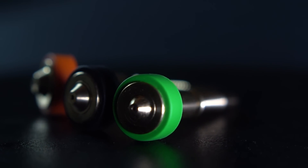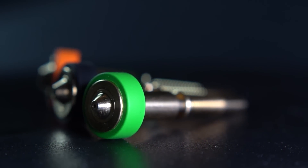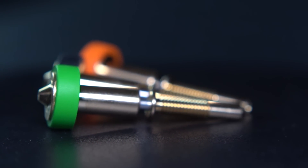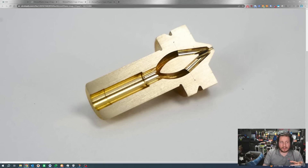With that being said, E3D has actually kept these nozzles relatively affordable given the technology and effort that went into making them. At about $40 a piece, while they're not cheap, these will enable you to run high flow materials. If you are looking to play on the fringe end and want to do it with E3D's Revo system, this is how you start. But unlike the Bontech CHT, which is just basically drilled to get those holes, this is a two-piece system.